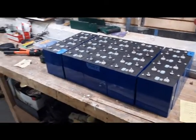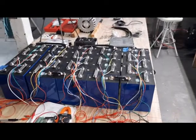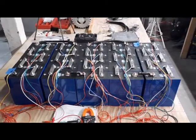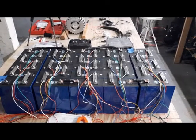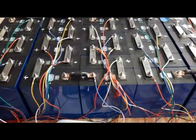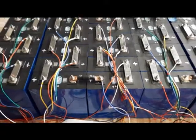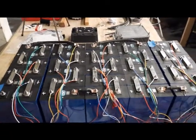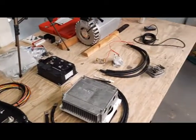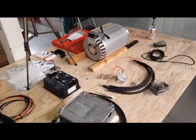That's it for batteries for now. That's the port side bank of 30, which still needs to have the leads made up. This is the starboard side bank of 30; the active balancer has worked out really well. The two active balancers don't actually show up on one screen in the app — I'm not happy about that, but it is what it is. I'm going to use these number 1 shunts I made up where the solid copper bars don't fit; they're good for over 300 amps, so I'll go with those for the final install. Got some longer shunts made up for testing purposes, and we're going to get to the fun stuff here hopefully in a little bit.